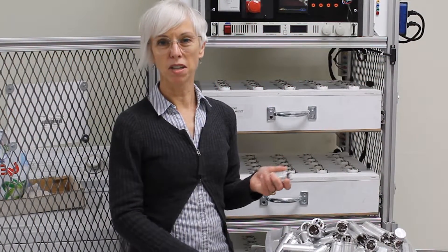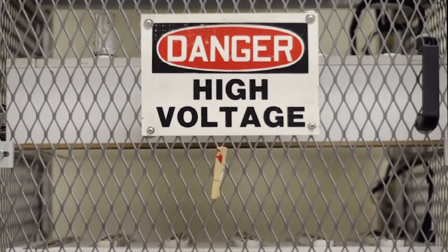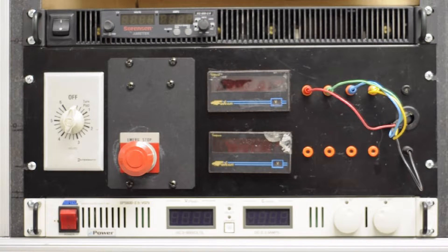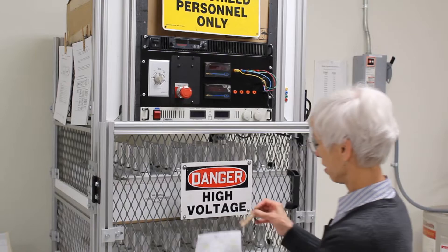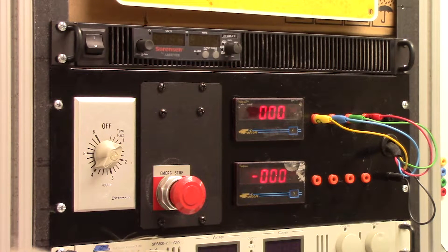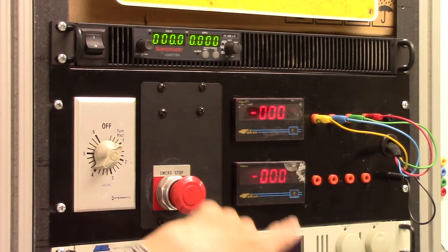These capacitors just came off the canning process and are ready for the next step, which is forming them. In order to form them, we use this aging rack. This aging rack will hold 100 capacitors at a time — 25 on each of these shelves. It also comes equipped with two power supplies, which is very handy when aging capacitors whose sections are at different voltages. I loaded all the capacitors on the aging rack and we're ready to get it started. In this case, 100 capacitors in all, we limit the amperage to about 1.3 amps.